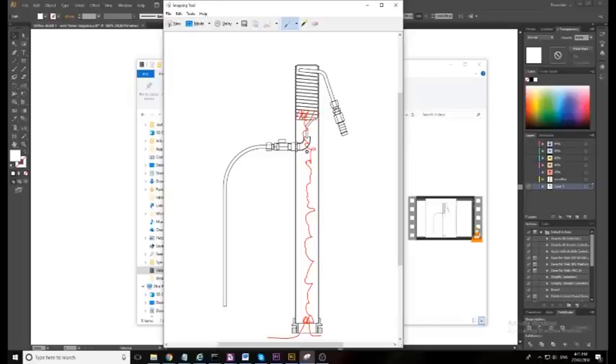If you've got very cold water the vapor will condense just on the bottom part of the coil. As your coolant water starts to heat up you may find it starts condensing a little bit higher, and if your water is really too hot you can actually lose some vapor out the top of the still — you'll smell a spirit smell. Usually if your coolant water exceeds 38 degrees Celsius or approximately 100 degrees Fahrenheit that could be an issue. For most users the spirit will condense on this part of the copper here.